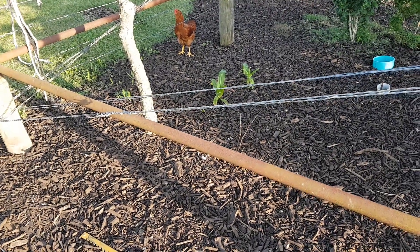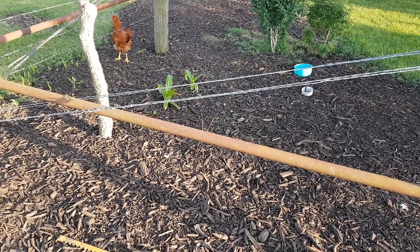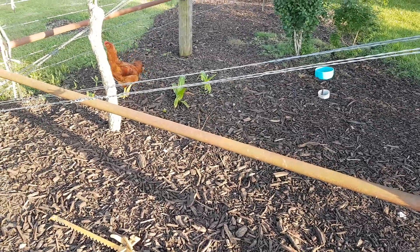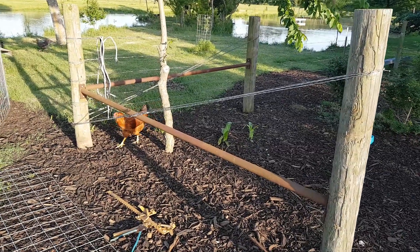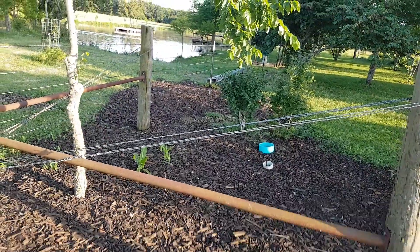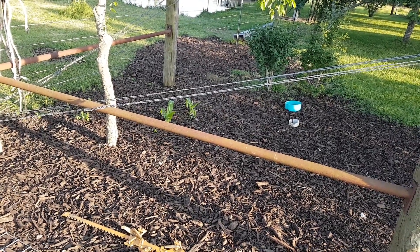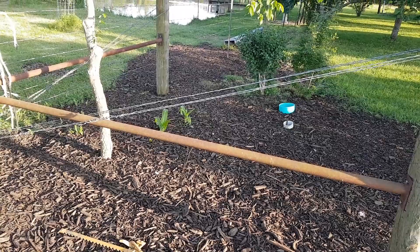Good morning YouTube. So this was an idea I had after fixing a couple of fences. I really didn't like the metal stays that get used on H-posts — that's an H-post. The tensioning wires brought it out so I've got to replace them. The metal stays felt very dangerous; they're under a lot of tension and over time they just fall out. Animals mess with them, they fall out, and all of a sudden you lose all your tension on your fence and there goes your H-post.